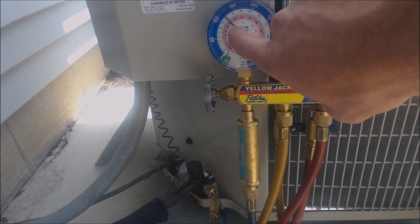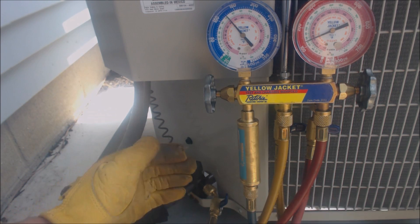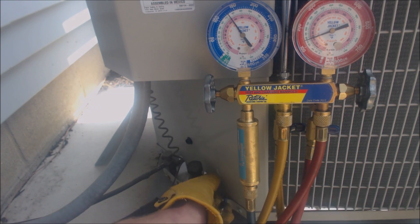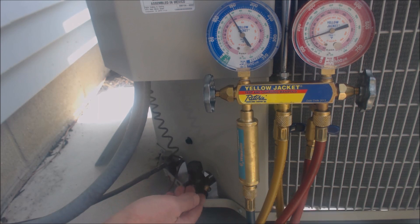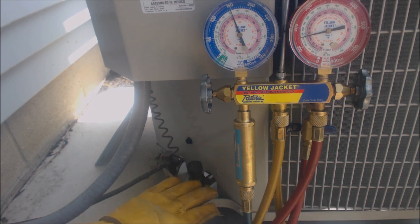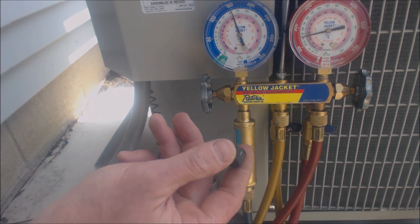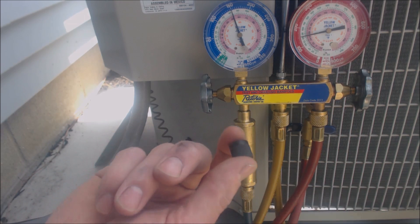Now that you see that both gauges are equalized — basically the same pressure on both sides — we're ready to disconnect the blue side. You want to disconnect the blue line before you shut the unit off because right now it's at a lower pressure. It's best to disconnect it now rather than later, because if you disconnect later, this side will equalize with that side and this pressure will be going up. So it's better to disconnect from this while it's lower than it normally would be with the system off. Now I'm going to check to make sure that these Schrader valves are not leaking — I've been coming across a lot of leaking valve core Schrader valves lately, so I'm going to show you how to check these to make sure you don't leak refrigerant out. These little plastic caps don't seem to hold the refrigerant in, nor should they — they're a pretty cheap design. Sometimes they may hold some in, sometimes they won't. I prefer the brass ones.